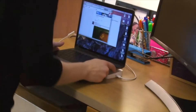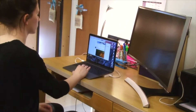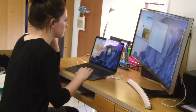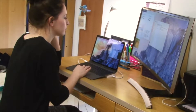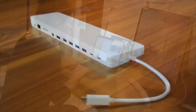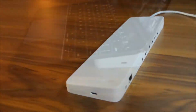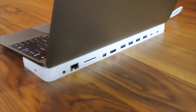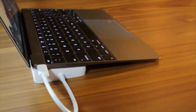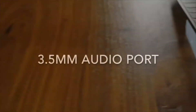You need to understand that the whole USB world is in a massive transition from the established 3.0 standard to a whole new set of completely new standards, including 3.1, Type-C ports and cables, a new power delivery standard, new device configuration standards, video alternate modes, and more. All together, it's an astonishing step forward, and Apple was the first to put a completely standards-compliant new USB product to market with the new MacBook.